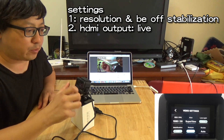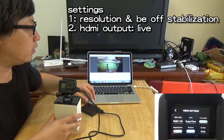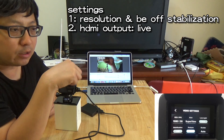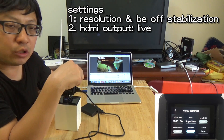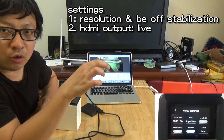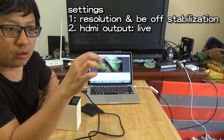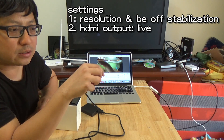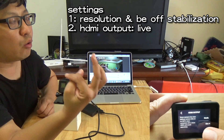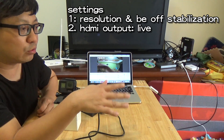This video clip shows how to use the GoPro Hero 7, connect the FeBom 180 UVC HDMI grabber, and do live streaming. Two key points: First, select HD 1080p 30fps resolution and close the stabilizer — this is very important because if you leave the stabilizer on, the video will have strong delay from the HDMI source. Second, select the HDMI output mode as Live — there are three modes: Live, Monitor, and Media. Please select Live. Follow this video to do your Facebook Live. Bye bye.